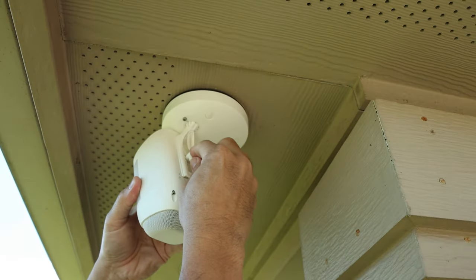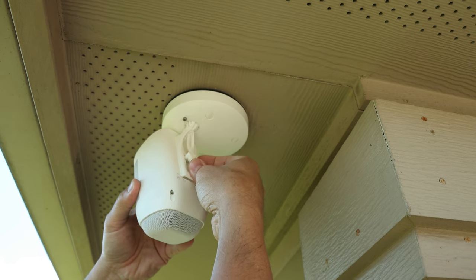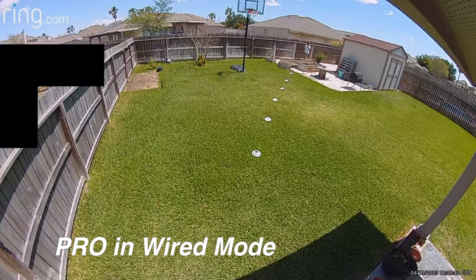The PIR sensor's weakness is a limited detection range of only around 25 to 30 feet, and it tends to detect late when motion is moving toward it. This PIR sensor is also responsible for waking up the camera to start recording, so the camera only starts recording when the sensor detects movement within its range. When you power the camera with continuous power — plug-in or wired — it changes to camera-based detection, using what the camera actually sees, so it's always on and just monitoring.